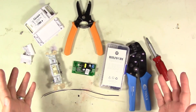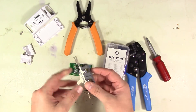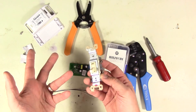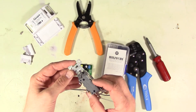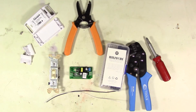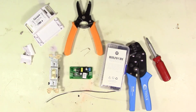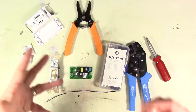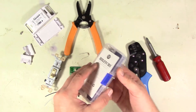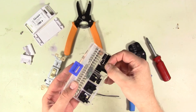Once it's all programmed up, it's time to build our override switch. We're going to use the same switches that are in walls - these just switch two poles when you turn on and off. If it's good enough for 120 volts 15 amps of AC, it'll definitely work for a little DC current. You'll need all this stuff in front of me, plus a pull-down resistor - this one's 2k, you could use 10k, it doesn't matter. You also need a couple pieces of wire; I've got one of those kits from Amazon with crimp connectors and housing.